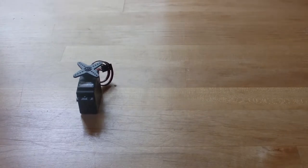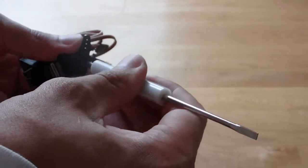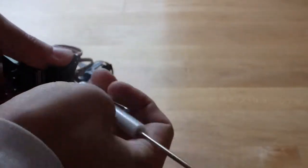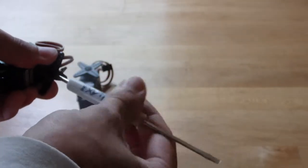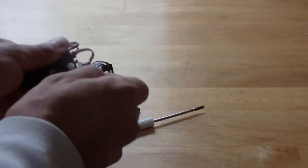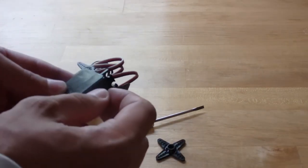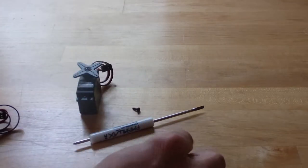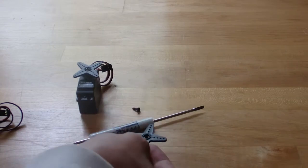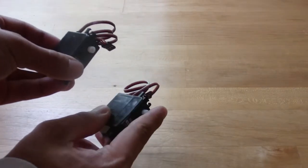Luckily this is pretty easy to modify — there's a Phillips head screw right in the middle. Take the Phillips head screwdriver, put it in there, and start taking the screw out. Once it's out, just let the control horn fall down and pull it right off. Now we just have the output shaft of the servo to work with later for the wheels. It might be a good idea to put the hardware in a little bag in case you want to use the servos for something else later. We want to do that to both servos so they both have the exposed white shaft.